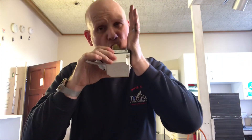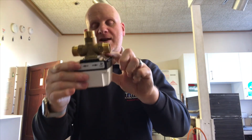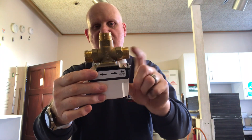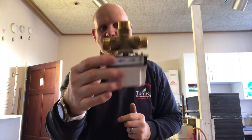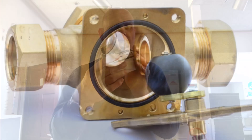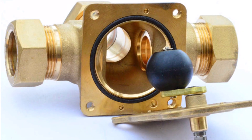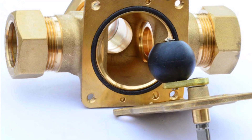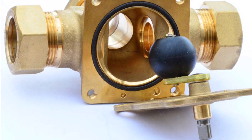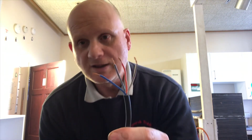If I block one side, air comes out of B — and B is hot water, so its priority is always hot water. The photograph shows the cam which the ball is attached to, which enables the valve to move into these three different positions. Now let's have a look at the wiring on this head — this is for a Y-plan.